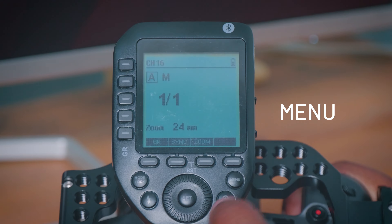Start and it's going to scan all the channels that are available. I'm presented with eight channels that I can use. Let's just use channel 16, so what I need to do is to go back up to channel, press set — once that's highlighted, that's channel 16.